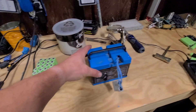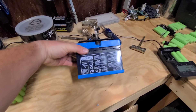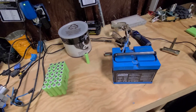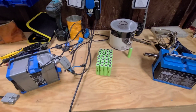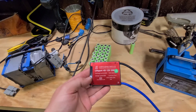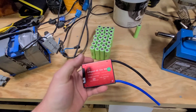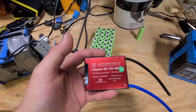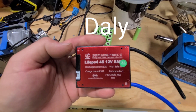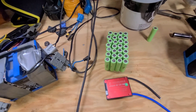Over here these are all the good ones I've gotten so far. And these are the old batteries for my power wheels — I have two power wheels and three kids. These are 12 amp hour 12 volt batteries. My goal here is to make more batteries for the power wheels that last longer and run better. Depending on how many cells I get, I'm going to do 4s — not sure how many p yet. But this is the BMS I'm going to be using: it's a 60 amp 4s 12 volt BMS, and I'm going to be putting that on to this pack.